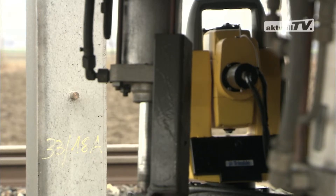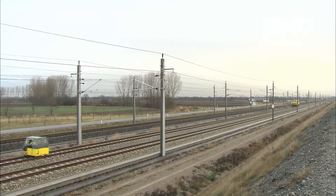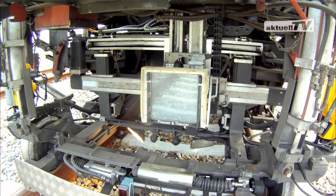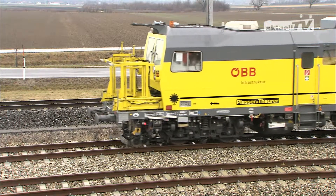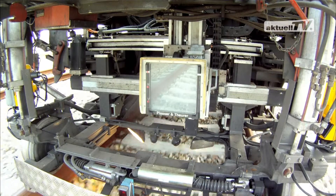In the meantime, the satellite trolley has been positioned at a suitable distance in front of the machine, and its leveling and alignment laser aimed at the receiver camera of the machine. Now the machine travels forward to the next reference point and measures the track geometry, using the laser beam as a reference base.